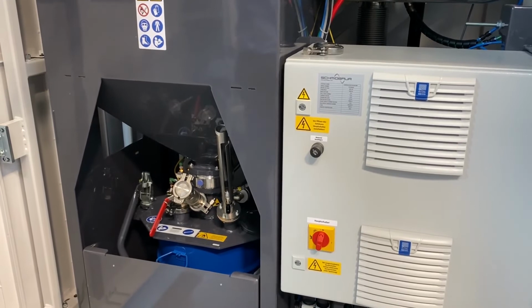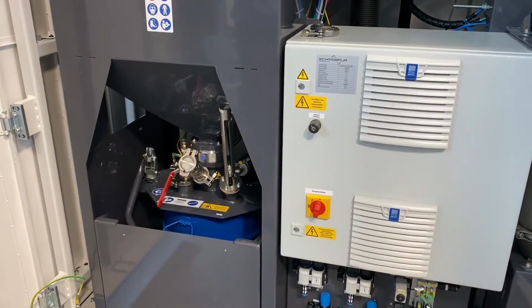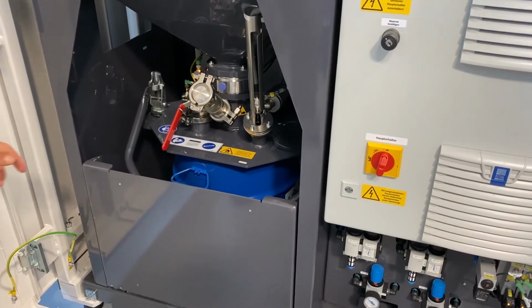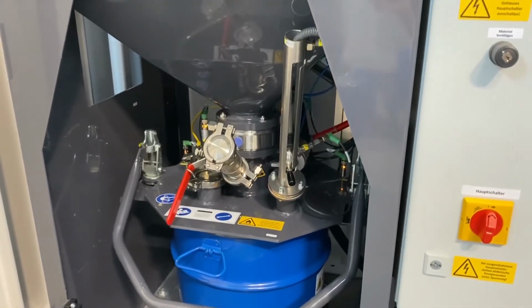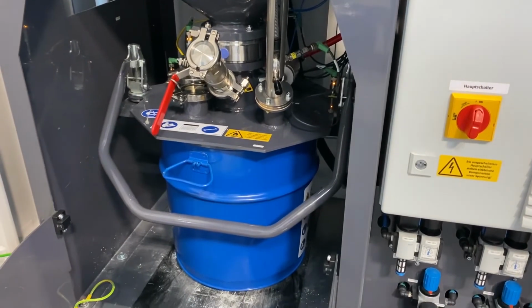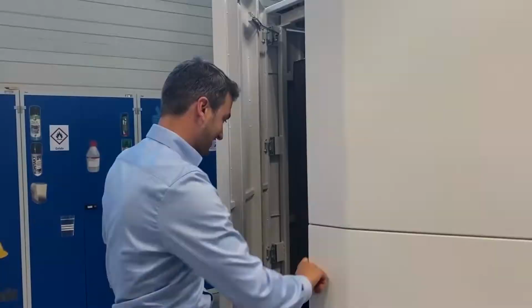The material falls from the filter into a collection bin, which can hold several cleanings. Depending on the material used, the operator must replace the collection bin with an empty one in regular intervals, but after 70 hours at the earliest. The printing process is not interrupted in this case. For a safe further transport, the collection bin, filled with condensate and limestone, must also be completely passivated by adding sand and silicone oil.